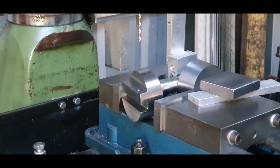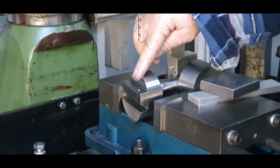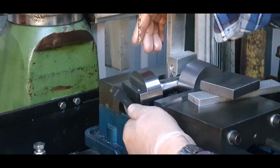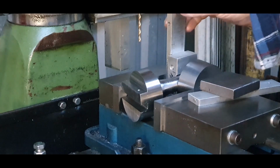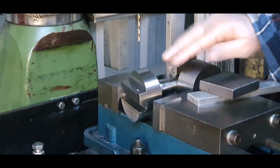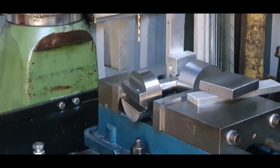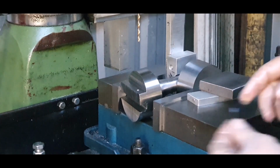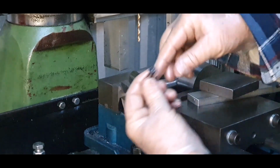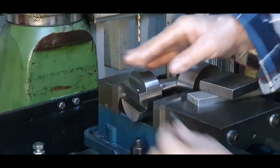All right, so I've turned the actual jig on its side here, so we're going to put 3 bolts in here, and then once the 3 bolts are in, we can put this back in there and bolt it up. At the moment, I've used my V-block and a couple of other blocks to hold that there. This part's free, I can't see any movement, so it should be all right. Anyway, we'll find out. So what I'm doing is putting in 3 6x1mm bolts, as you can see. Now they will sit in here, then they'll lock the unit together.